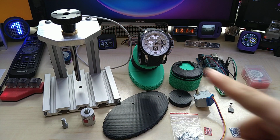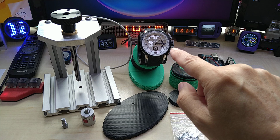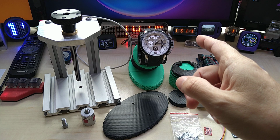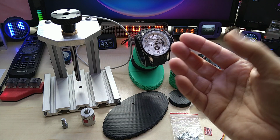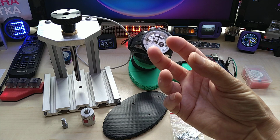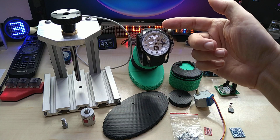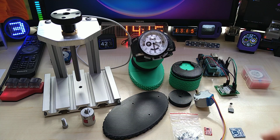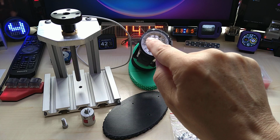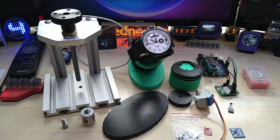And these are rather cheap watches. This one was a little bit more expensive, and I know now why, because it has a Japanese movement. I forgot the number, sorry. But while I was changing the battery, the second hand fell off. And then I had to open it. Unfortunately, when you open the back, the movement does not come out from the back because the dial is bigger than the casing. So I had to take off the front bezel to be able to get the second hand on, and I got the second hand on and put it together, and then the top hand fell off, you can see it if you have good eyes here, and I did not open it again.